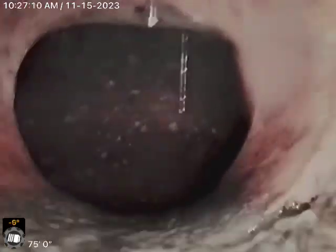We'll definitely locate where the system's running, and we can dial in where your property line ends with the sewer. So we're leaving your concrete pipe and we're transitioning to a clay line, and right here is your city tab. Your sewer system, counting footage from this cleanout right here, you're looking at roughly 70 to 75 feet.